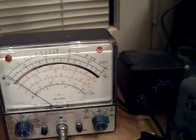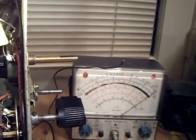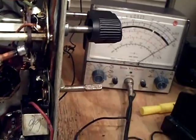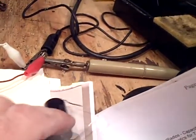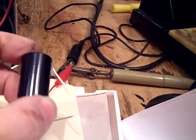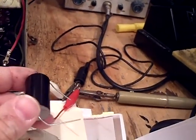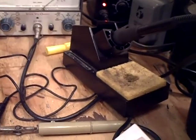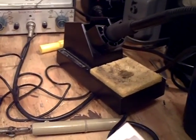What I'm going to do is test it. I've got a lead — I'm going to make sure the case is going to chassis ground. That's a good ground there. Before I test the original unit, I'm going to demonstrate with this new two microfarad electrolytic capacitor made in France. Let me hook that up to the meter and show you what happens.